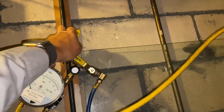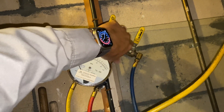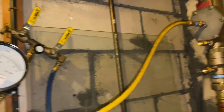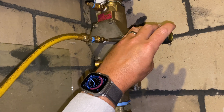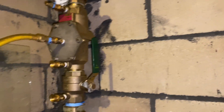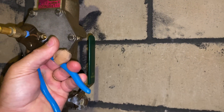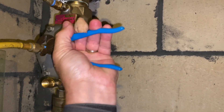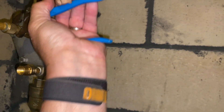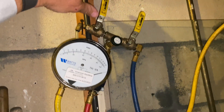Next, we're going to take our high-pressure hose and connect it to test port number three. We'll make sure all the valves are closed on our TK9A. Then we open test port number three. We have a little bit of discharge on our adapter — let's see if we can tighten that up. Still some discharge — may need to put more Teflon tape on that, but okay, better.